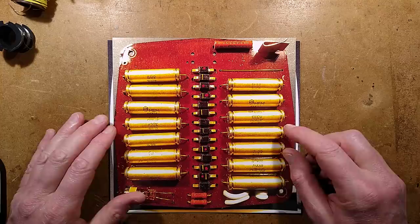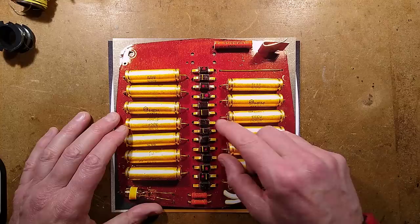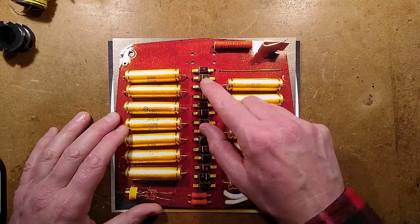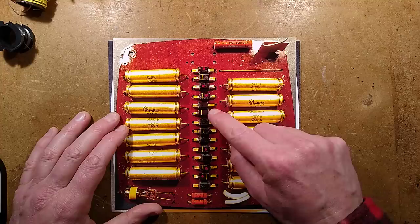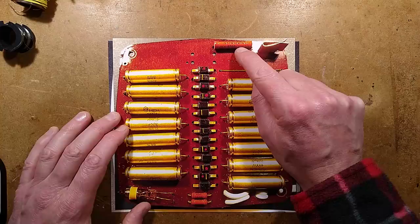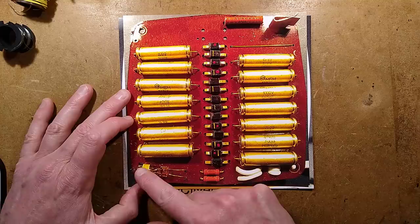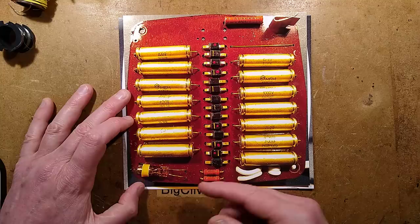This is very, very Soviet. It's using these big 1000 volt, 10 nanofarad capacitors, and the diodes are very chunky — rated about 800 volts at 300 milliamps. The 1N4007 would have been better here, but this was presumably manufactured in Russia. The yellow line is the polarity indicator, and the red dot is supposed to indicate the voltage rating. There's the clip the wire goes into, and the output resistor — which is a staggering value — is over a gigohm. And oddly, they've got one megohm in series with the neon. Normally with such a high value resistor in series, the discharge is unstable and tends to flicker about like a neon flicker flame candle. Interestingly, the manual says if the neon is flickering like that, it's not a fault — it's quite normal.